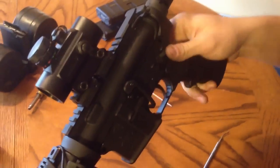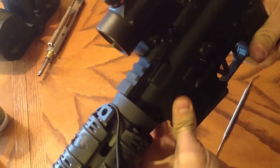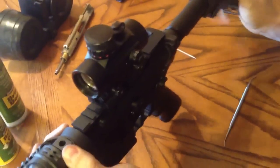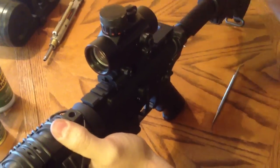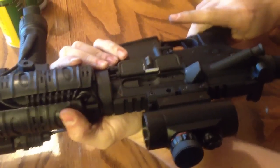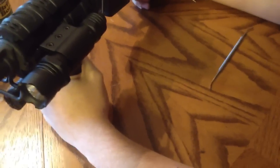Then all you have to do is reconnect these two parts. I got my pin together, there it went. Shake it around — now if you hear a clinging noise, that means your firing pin isn't in all the way. But if you don't hear anything, you should be good to go. The clinging noise just means your retaining pin is behind or in front of your firing pin and didn't lock down all the way in place. Now she's ready to go.